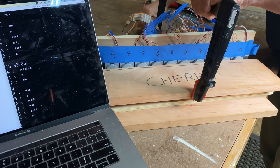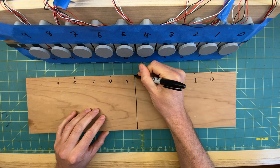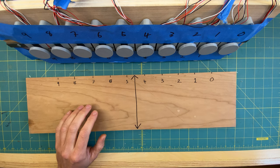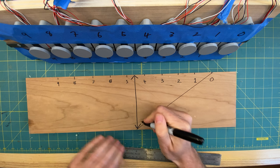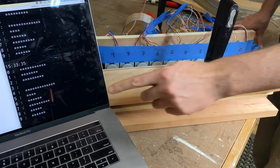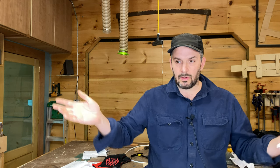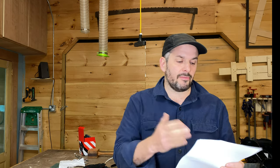I started off using boards that are 135 millimeters wide — about five and a quarter inches — and clamping down at the center point between measuring spots four and five. In this setup the angle to the last puck on the edge is only 53 degrees, and the solid woods did a great job of covering that span. That's equivalent to one and a third board widths on either side of the clamping point. So in this case the 45 degree rule is okay, although a little more conservative than it needs to be.